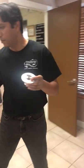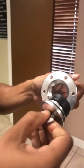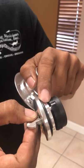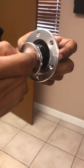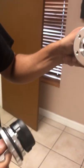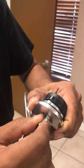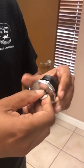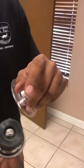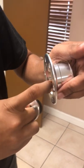This is how the gas cap comes, and there are two parts to it. You can see the mechanism — there's a plastic element and then there is a billet aluminum element. When they line up, you can actually slide out of these things. When they are unaligned, which they can be unaligned one way or the other depending on which way you force it, when they're misaligned it's closed and locked up. There is this nut at the back side, and you can see that gap actually goes and locks here.